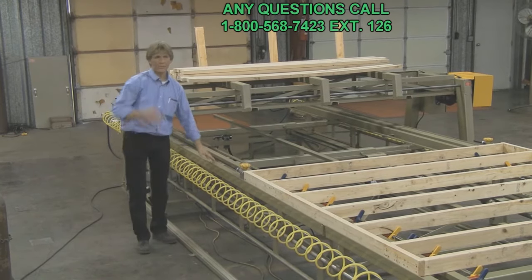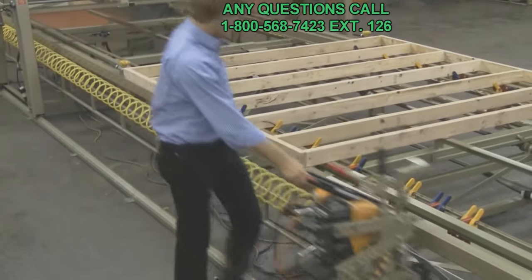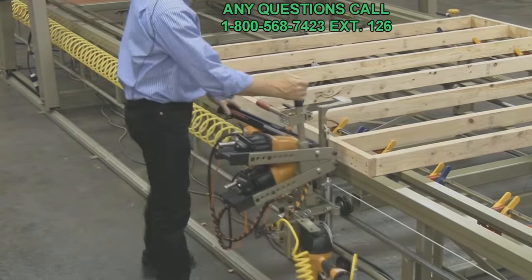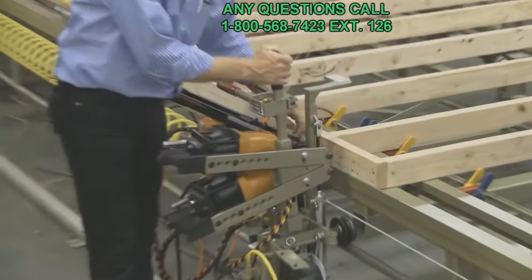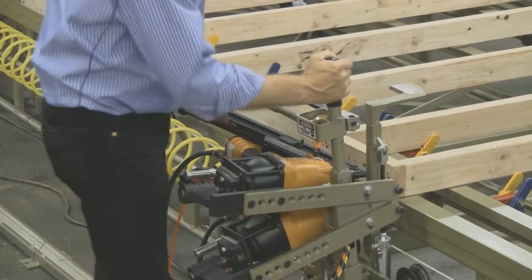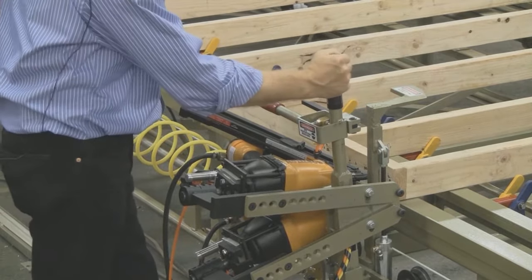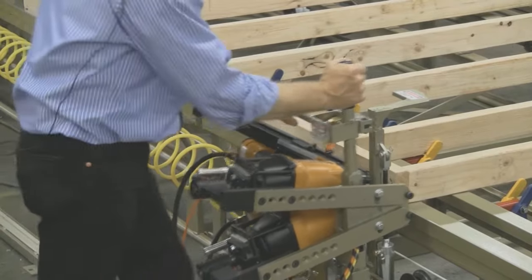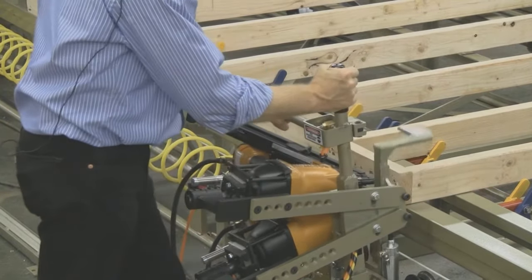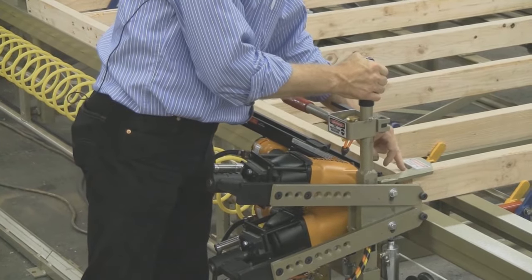Diamond quad scoring table — this is a fairly long table. You can see we've framed up a little wall here. We've got manual dollies, and there's also an auto dolly version. In the manual version, we're coming down with the down clamp. You're going to line up the nose of the gun with your 2x4. The operator's got the right handle on the black knob, one on the red. You come in, the down clamp comes down, and you're actually flushing the plate and the stud together.